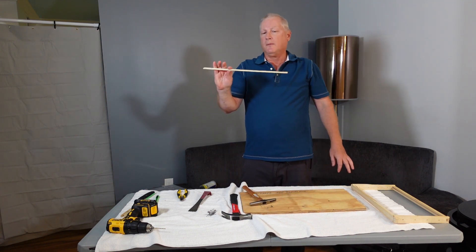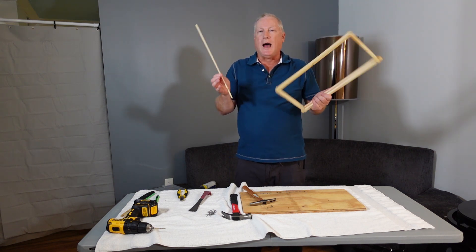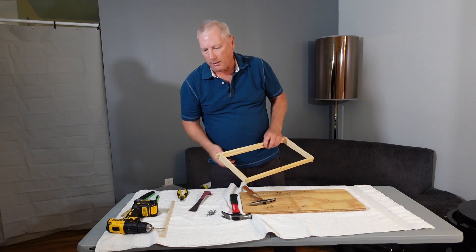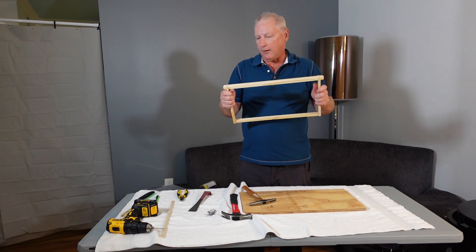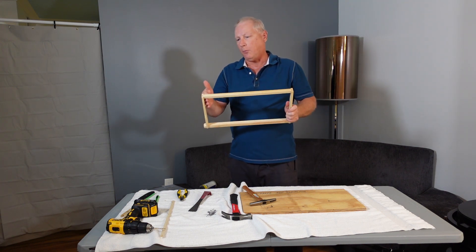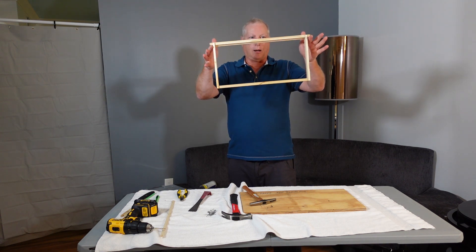To save time I do a bunch of these during the winter — it's a great wintertime project to build frames so that when I need them in spring or summer they're already done, just stacked in a box. That is how to assemble a frame — literally that simple and without any glue. You can see I'm pulling on it pretty tight and it doesn't come apart. You could use a small framing square to check if it's perfectly square, but it naturally fits pretty straight.